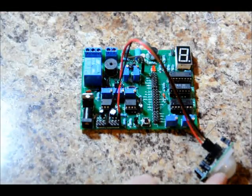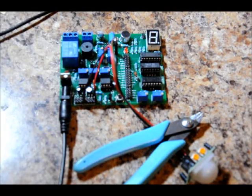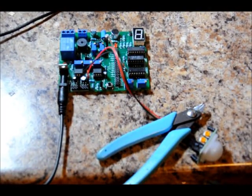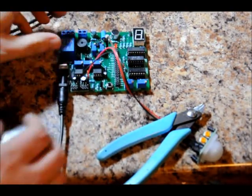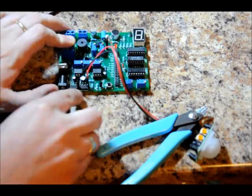Before we go on — that is your Fresnel lens, filtering out ambient light. One thing to note: as soon as you plug it in, the PIR sensor takes about 20 to 30 seconds to stabilize. The output just becomes wonky — that's the case with every PIR module I've played with. I'm in its line of view right now; I'll move it away and zoom out. I've got it facing my computer. Moving my hand in front of it — it detected me. I'll move away and repeat. I'm happy with my sensitivity — you can play with the resistors to change it.